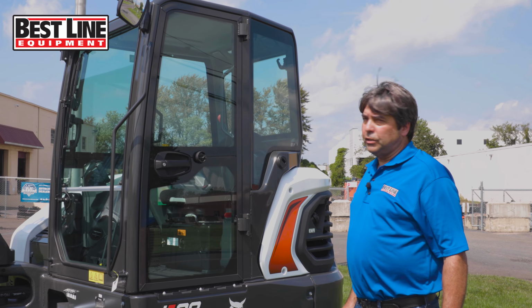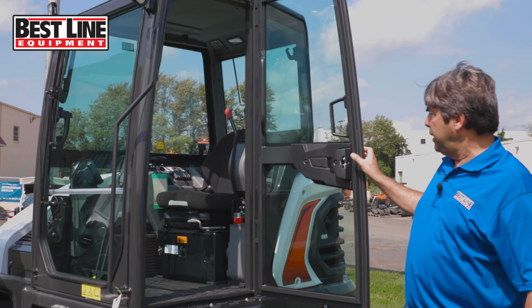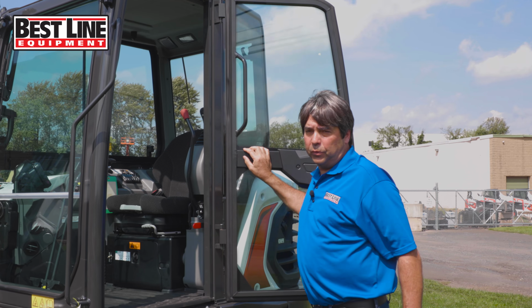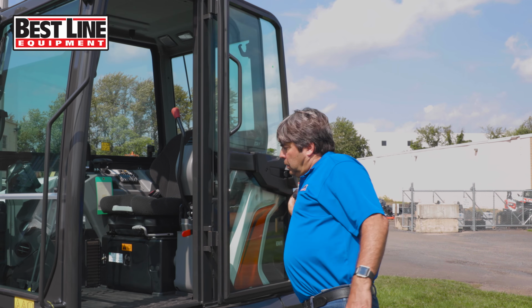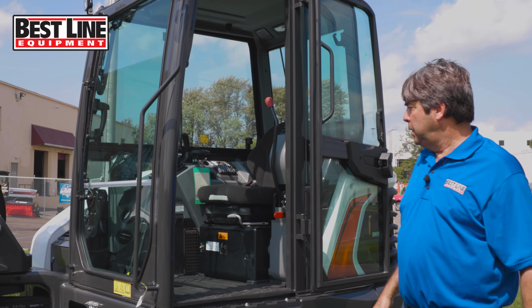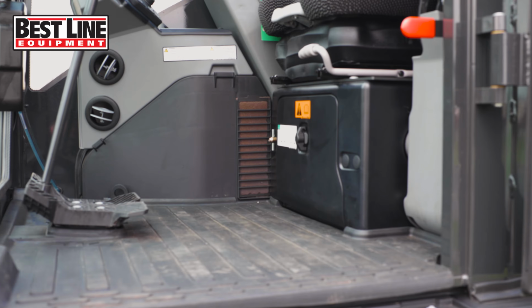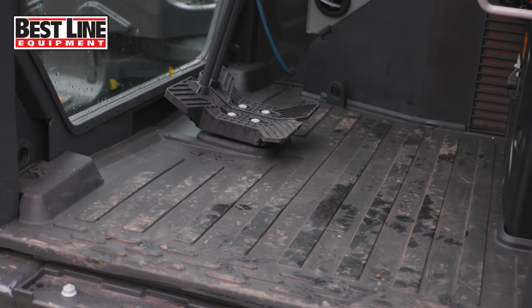One of the features on this machine is the R2 cab. It's a little roomier than the old machines. The window is strengthened with aluminum tubing. The latching system conforms with the other R2 series machines. They keep the floorboard open. They've gone to a single pedal to give it more durability than the foot-type pedals.